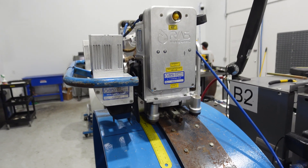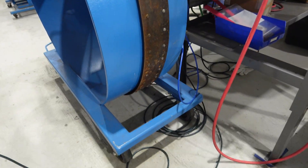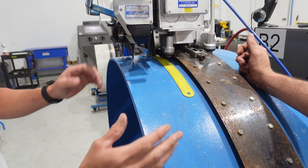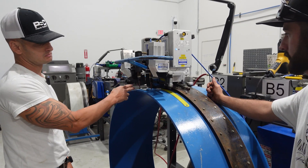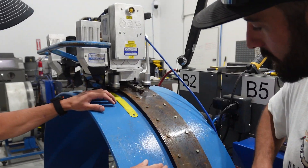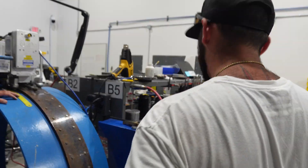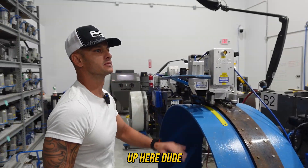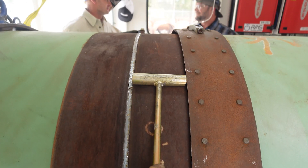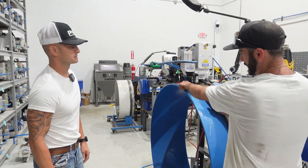This bug right here — the only way it can operate on a piece of pipe is you've got to get this band on first. Right here is where it goes together. Make sure that's on top — it's on the side. You can hang it on the side; you can cheat left or right a little bit, not a whole lot. Same thing with these fit points — you get a band hammer. I carried one around on my belt all the time so I could check the spacing on the bands, because they've got to be a certain distance so that bug can line up correctly.